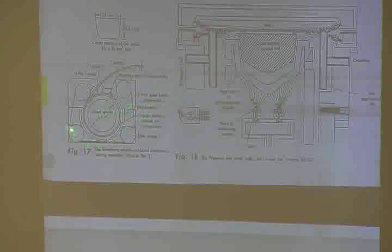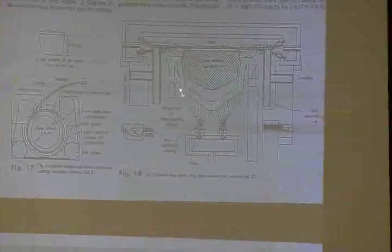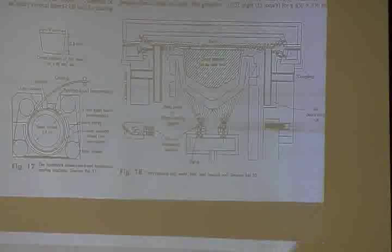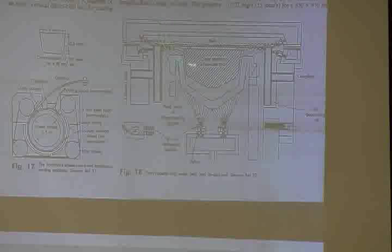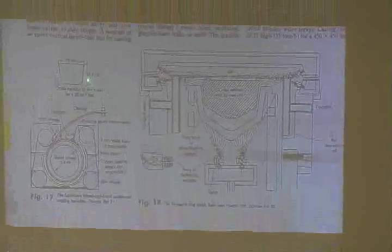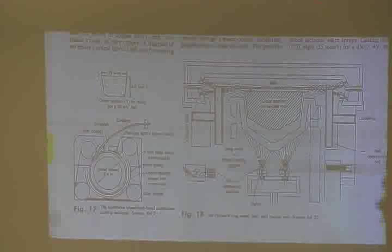You pour it in and it comes around and out the top. The South Wire is 2.4 meters in diameter - a steel wheel with a spray band - and you end up with a bar. Here's the actual cross section: the steel wheel, the spray, and the as-cast rod. You're going to break that down and turn it all into wire. You're casting copper, which has very good thermal conductivity. The cross section is about 75 by 52 millimeters - roughly two by three inches, a 35 square centimeter mold for the South Wire process.